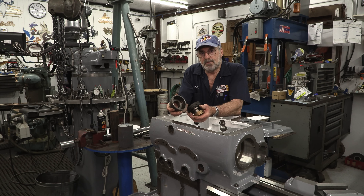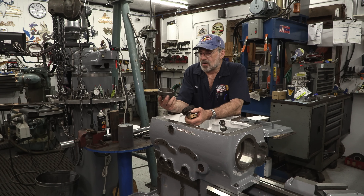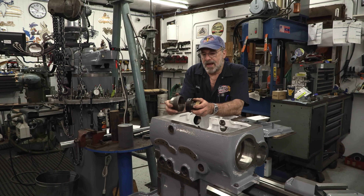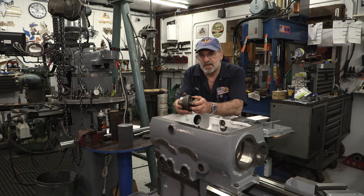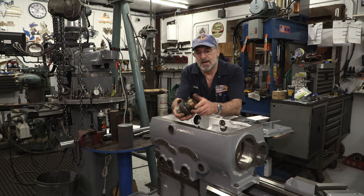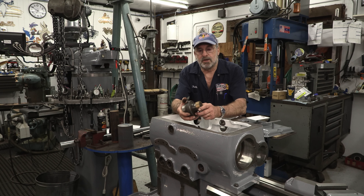I'm just kind of explaining what my first repair projects are going to be on the gearbox here. We're going to get into some real machining and we're going to be stepping back in time when I was doing videos that were more into the actual machine work itself. We're going to be redoing the brake lining on this and we're going to be turning a new housing. This has got some irregularities in the surface, and I'm looking at the amount of taper — like on a propeller you have draw — the contact area, the travel of your shoe and where it's going to bottom out, where it's going to be effective, and also the amount of travel. These are all adjustable in the linkage as far as how much clutch and how much brake you can engage.